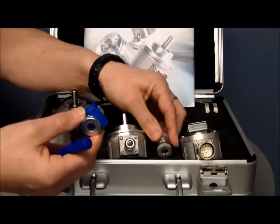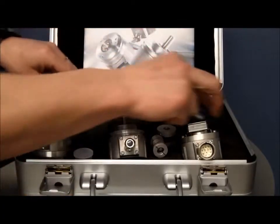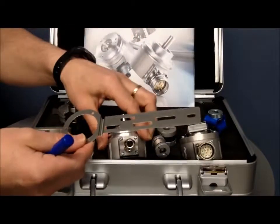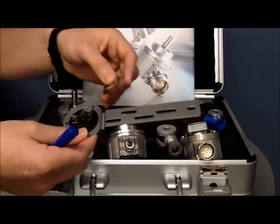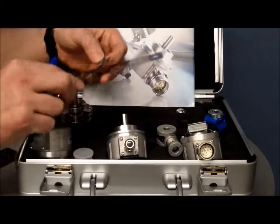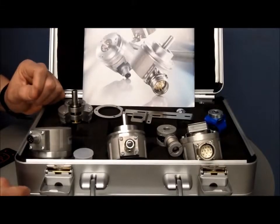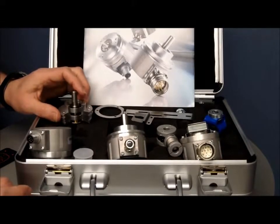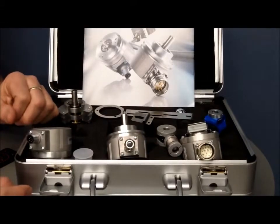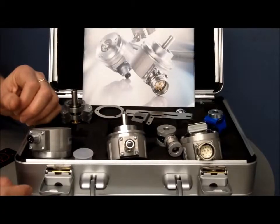The couplings come in bellows and flexible couplings. For the hollow shaft, there's a variety of tether plates — a large tether plate and some smaller ones. So the whole range of EIL 580 encoders comes with a very robust construction and all of the common varieties of connectors and mounting flanges, and a good range of pulse counts.